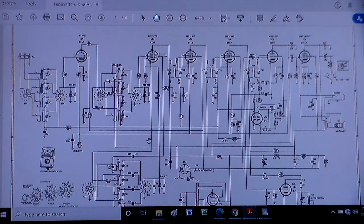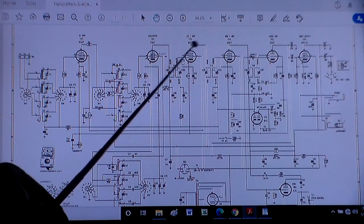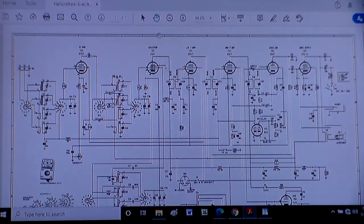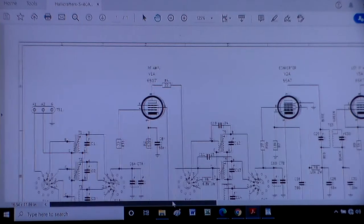Basically what I wanted to show you is — I can remember from being a little kid seeing radios, they always talked about the intermediate frequency. You'll hear a lot of people say the intermediate frequency, and that seems to be the first thing you set. This area right here — first IF, second IF — it just means that there's two different amplifiers, first and second. Better radio, more gadgets. They both pretty much do the same thing; one follows the other to make the first one better.